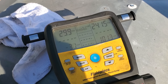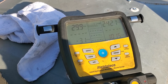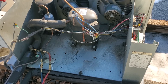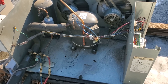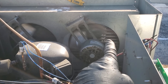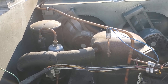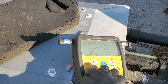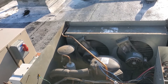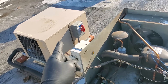We're going to let it run for a while and make sure the box comes down to temp or gets close. It was pretty warm in there. I can see through that condenser now — you can actually see right through it, it's clean. Temperature is about the same, running real nice. I'm going to take my gauges off. I went ahead and rinsed off this one and this one, but I didn't take them apart — I don't think they're that bad.